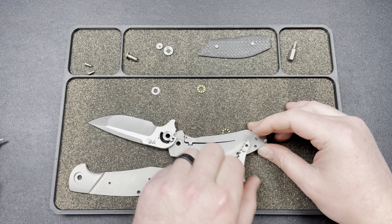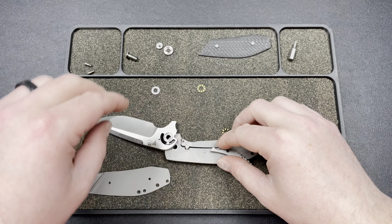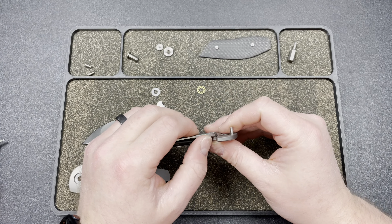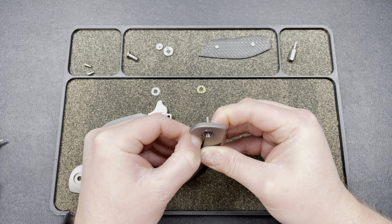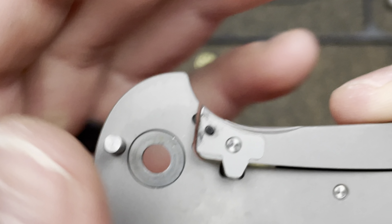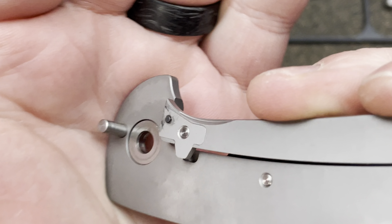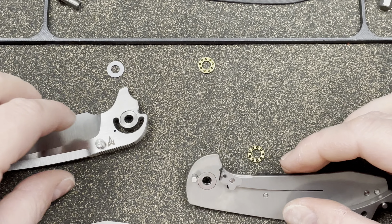Here's that backspacer. Let's see if we can get that back in place. The frame lock was blocking it. So detent on this is already pretty good, so I don't think I'm going to mess with it. Here's the thing with the Varga VBR — you're getting this flattened detent ball. You see that detent ball? They basically either put a flat one in, or I think they just shear off the top of the ball. And that gives you a flat detent.